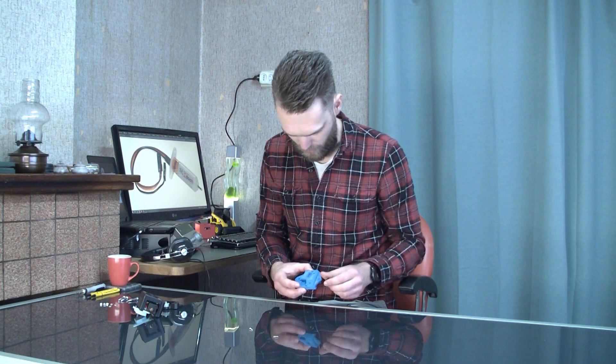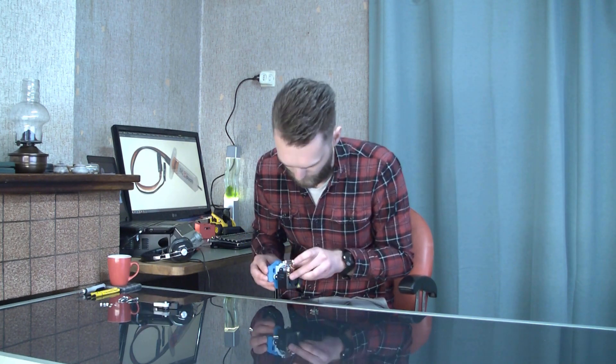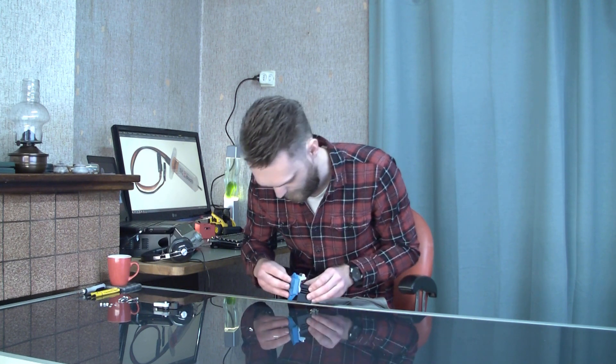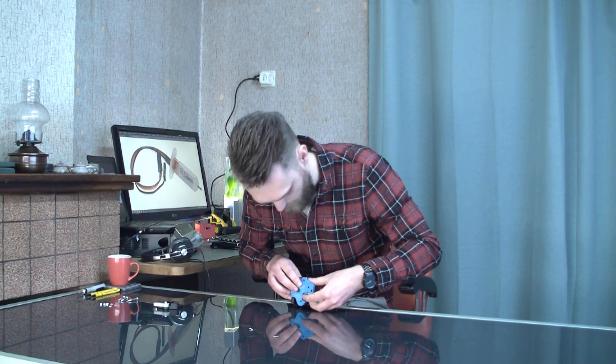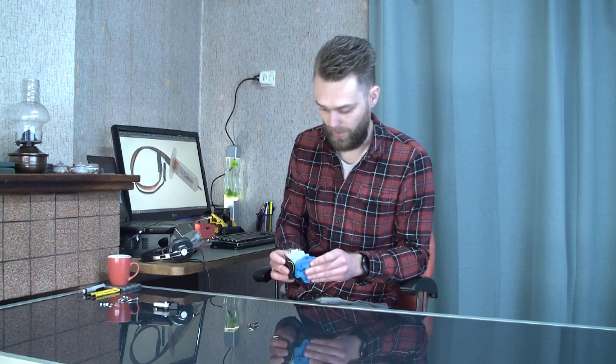The idea is to mount the switch in here and put a homing switch into the quick tool change mount. If it goes down and the tool hits the build surface, then the gantry will push it further down, triggering the switch. In theory, I can just put any build plate of any thickness inside the printer with any tool and just home like this, then we can start printing without even thinking any further.